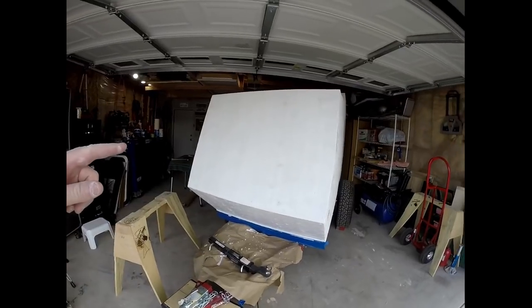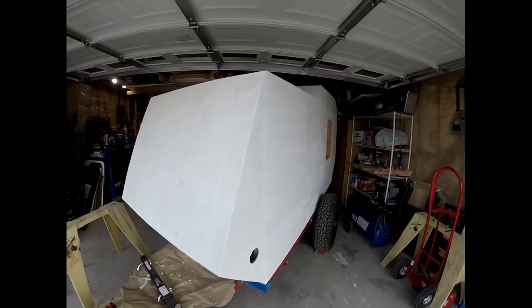It's 6:19 and I came back out about an hour ago and did another coat. You can see it's just barely tacky, but it looks to me like this final four-coat process has completely sealed this wood. You can see it's kind of dry, a little bit tacky — not enough to leave fingerprints. I think I'm happy with the finished product.